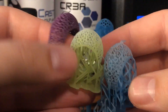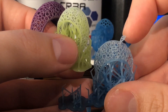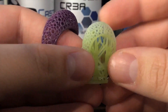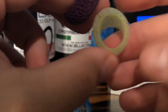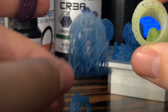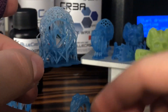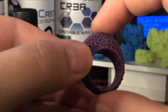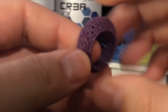The difference between these is palpable — the CR3A is spongy and cracks, and it actually printed with this flap, so it's a failed print. The X10 seems to have been successful but it's also warped. The other thing about the X10 compared to CR3A is that it's brittle — literally just a little bit of pressure and it crumbled into pieces. Compared to the Resinworks, it's a little spongy but also flexible, so I don't feel like I'm going to break it.